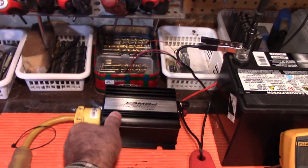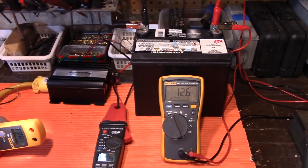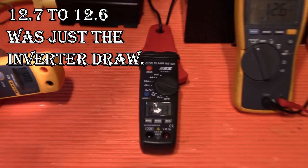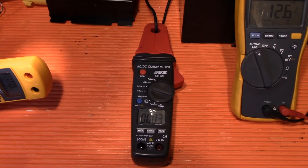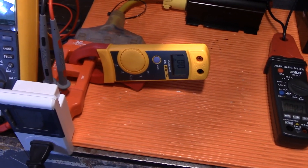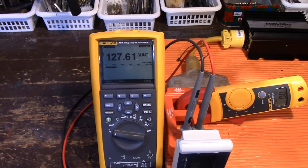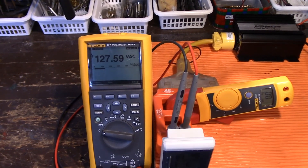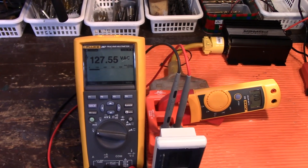I have a 100-watt bulb, and I'm going to turn it on and look at the values. Let's turn the power inverter on. The first thing you notice is nothing happened to the battery voltage. It's about 300 milliamps just to turn this unit on and have it run. There's no amperage going through the AC side, and the voltage is 127. You'll see in a lot of these smaller inverters that they will have a high startup voltage, but you're going to see how they drop when you turn any load on.